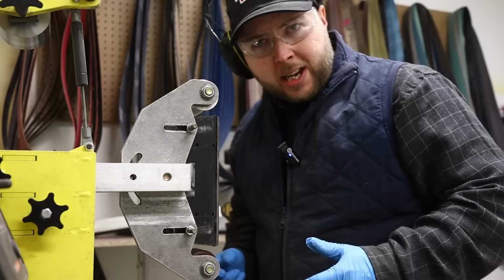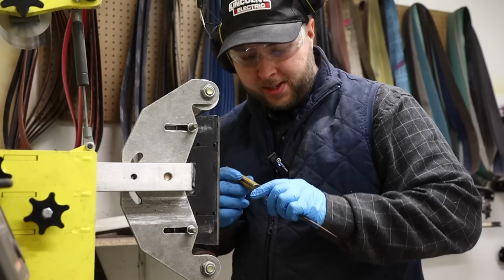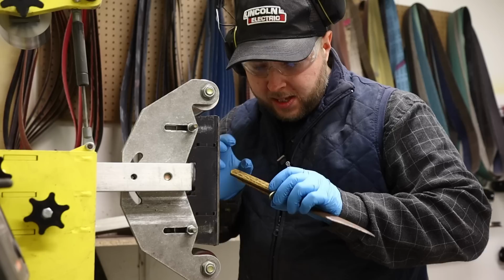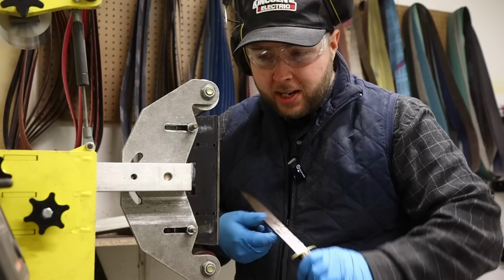Okay, I'm in the grinding room here now getting set up. The first step on this Joseph Allen's is to remove those scales. That way when I take it to the grinder, I'll see if I can easily pop off that brass guard as well. But we'll grind off the heads of those pins. Very quick and simple here. Snip, snip, snip. So we can punch them through. We'll pop those scales off. We'll remove that brass guard. And then we can go to town, wire wheeling, grinding out that tang, prepping for reassembly.